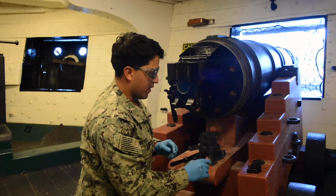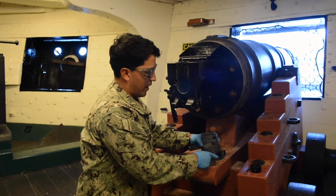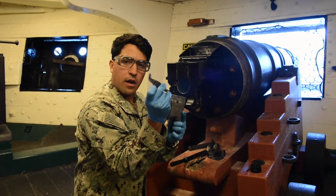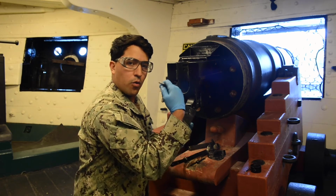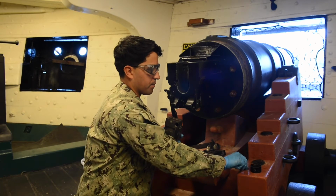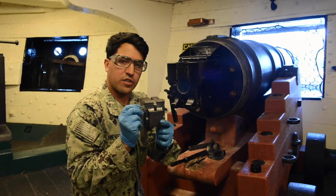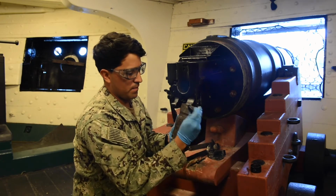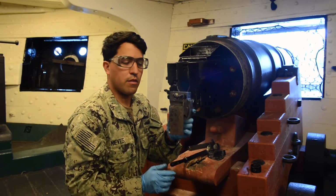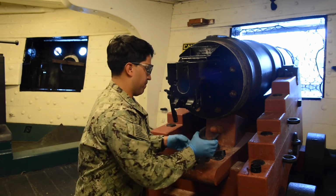like so. Then you'll take your outer cocking lever, and you see a little bit of the notch of the sear that's sticking out. The little elbow you see of the outer cocking lever is going to hold that. So it's not completely flush. That's okay. Use your cotter pin to pick up and adjust the inner cocking lever. Place the outer cocking lever like such so it's completely flush with the sear sticking out. Turn that back right side up.